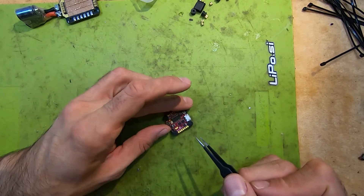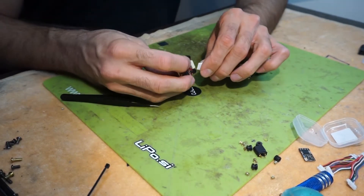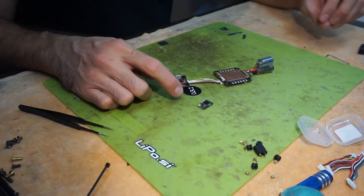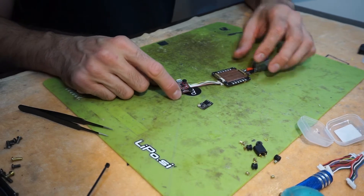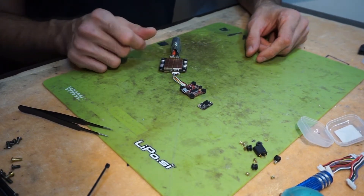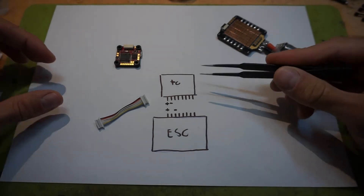In the next part of the video I'm going to connect the ESC, solder up my crossfire receiver, and solder up the VTX to the FC. You can use this video as a tutorial on how to assemble the Talon F7 Fusion. In this part I'm going to connect the ESC to the FC via the supplied cable.